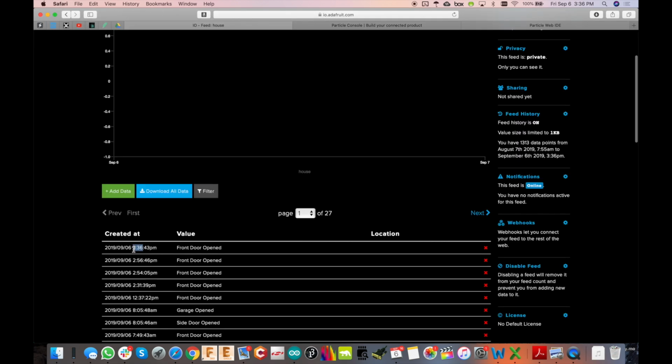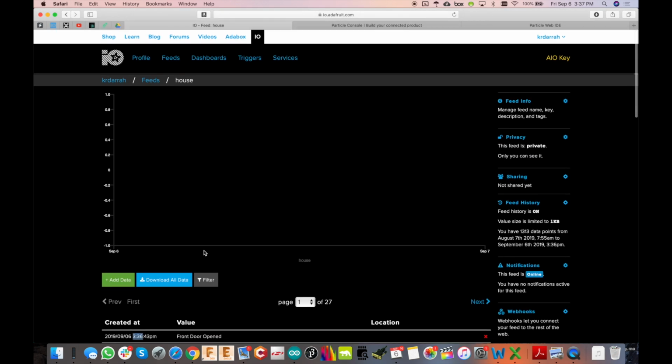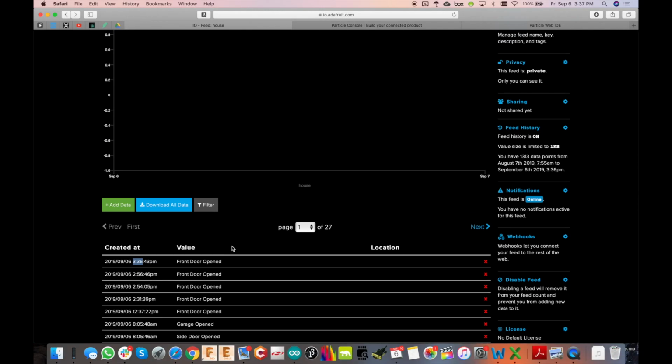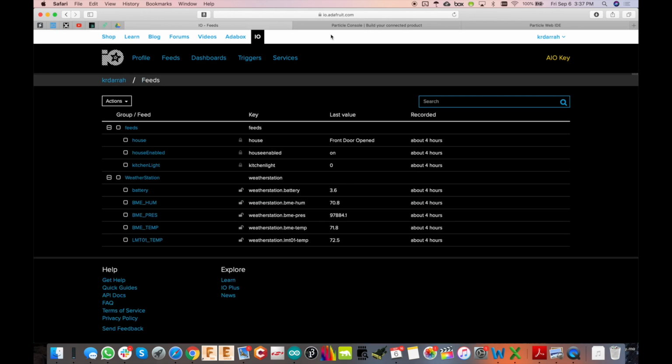So there's the timestamp on it, 3:36, and I just clicked that now. So every time I do this, all it does is put that there. And at the monitor side, essentially I have a callback anytime data is published to this feed. So that's pretty easy, but we might as well get this set up now. It's very simple. So you go to your IO.Adafruit thing, click on AIO key here. You're going to need that for your webhook.